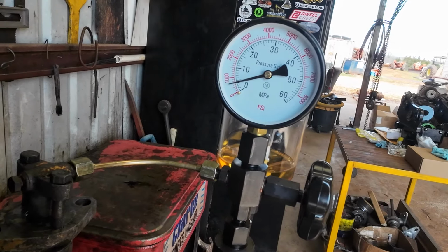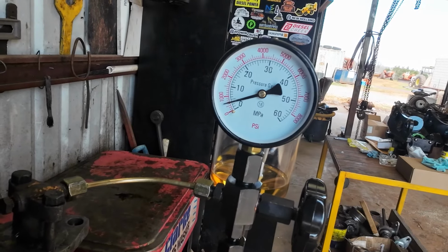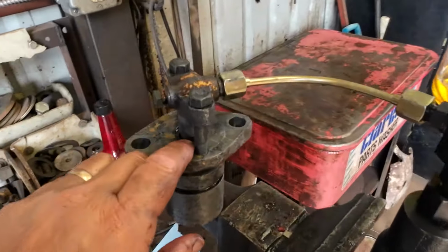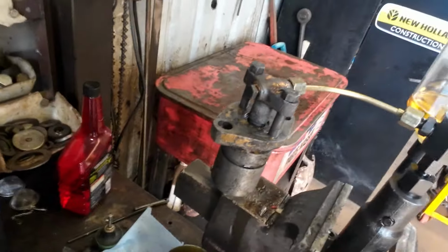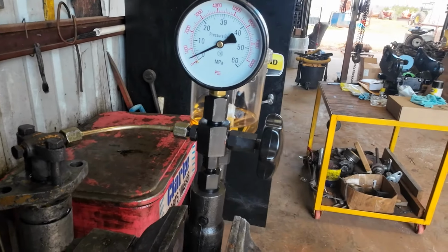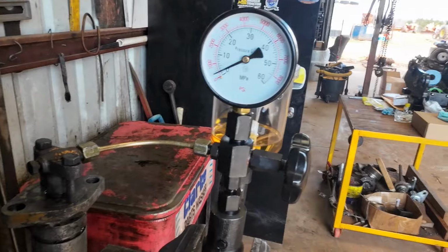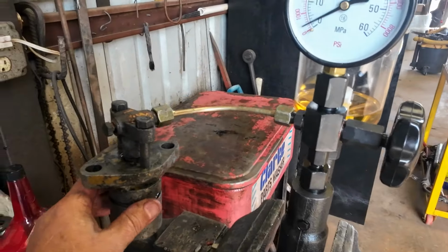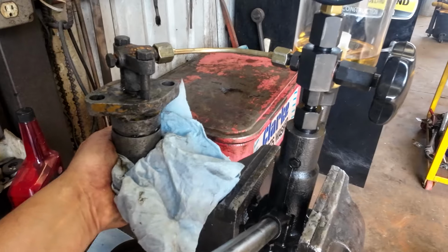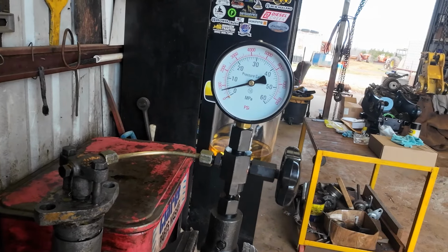That's about 6. Starts to crack there about 800, but then it leaks back down. I don't know if it's filling up this chamber with diesel. It may have a slow leak in here, or the check valve on this pump is not 100%. It's made in China, and it's not a high quality American made or German made. What am I trying to say? That I doubt Chinese quality? Well, they don't have the best track record.